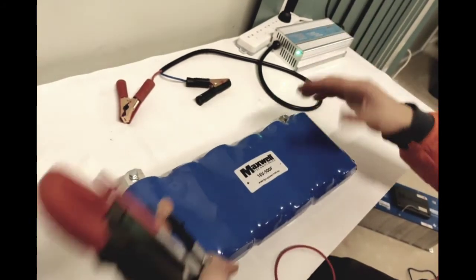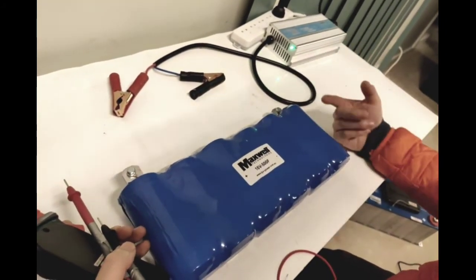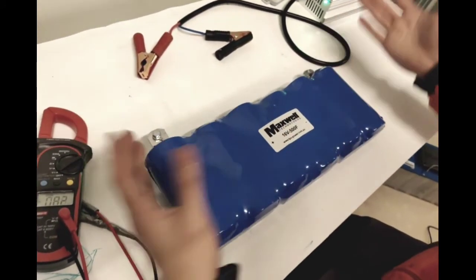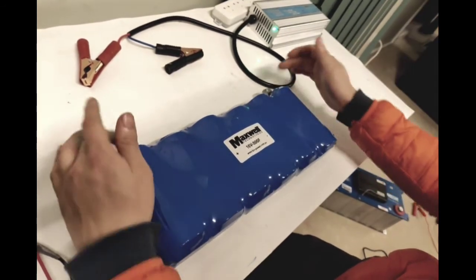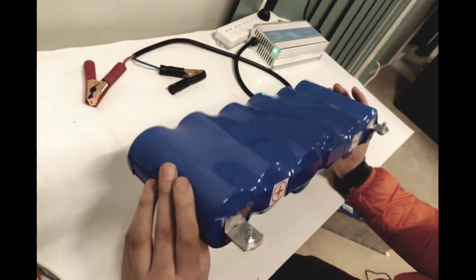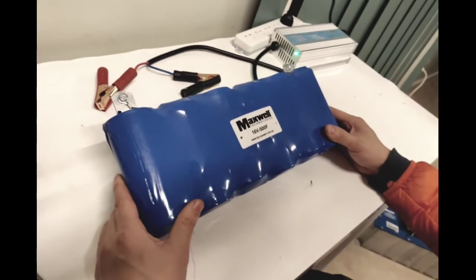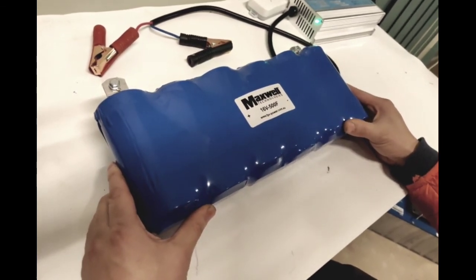The reason these chargers don't blow up is that supercapacitors will always try to draw as much current as possible, but battery chargers have a constant current limiting function. If you were to use a laptop power adapter or a 12 volt appliance power adapter without current limiting, it would blow up immediately. These supercapacitors are incredibly robust — rated for a million cycles, with very low internal resistance, and many years of life even under rough use. You can use them for starting diesel engines, car audio, or in parallel with any battery in a solar system to prolong the life of your batteries.